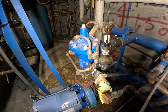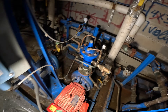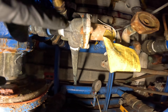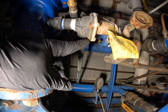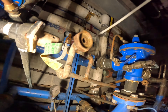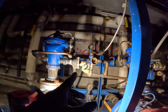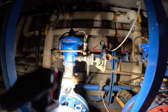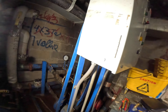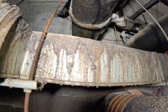Looks good to me. All right, that's looking good — ready to go. This relief valve is shot. This packing wet gasket here — I think it's done. I see a little water coming out through here too. It's just like an open thing — that's a disaster waiting to happen. We should at least cap that off. I would change that relief valve and cap that off. But this is the real nightmare that was happening here. Should dry up this whole pump, make sure nothing else is leaking.